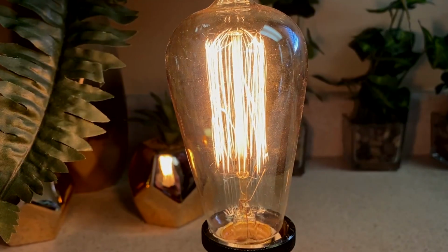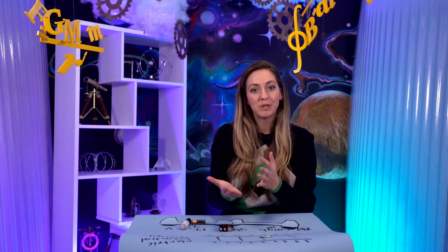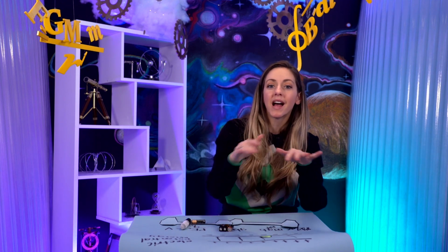So the second idea is why electrons flow more easily through some materials and not others, and why that current makes things hot. So electrons, typically in most materials, don't flow perfectly efficiently. There's always at least some interaction between the electrons and the atoms in the medium because they're flowing through and they're bumping into the atoms and jostling them around, passing off some of their kinetic energy to the medium. And that's why the material heats up. It's gaining some of that kinetic energy at the atomic and molecular level.